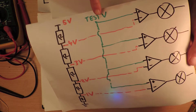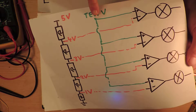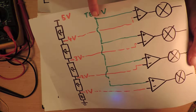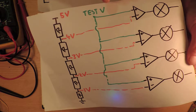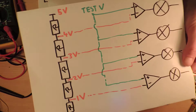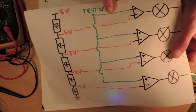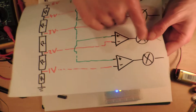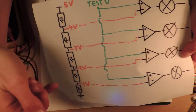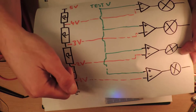So the test voltage — in this case coming from a capacitor and resistor in series — as the capacitor charges, there's more voltage across the capacitor and less across the resistor. That's what this capacitor here is doing, storing the voltage. There are four comparators in this case, but now there are six, outputting high if the test voltage is higher than the voltage at each divider tap. With all the same resistors, approximately one volt is across each stage.